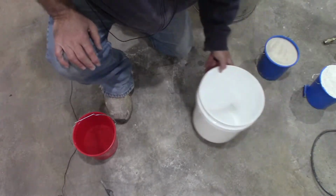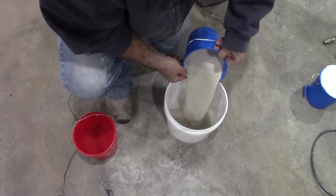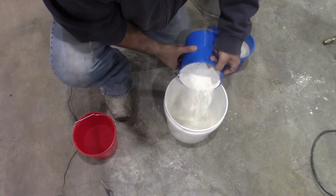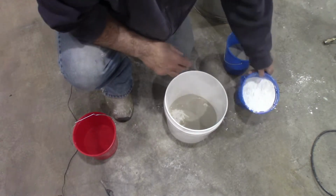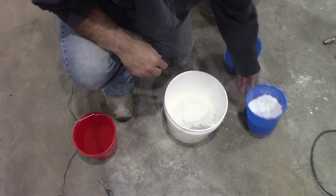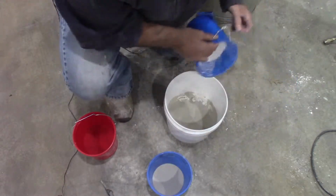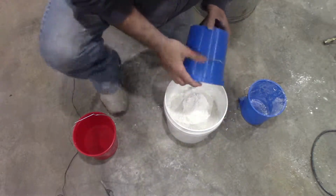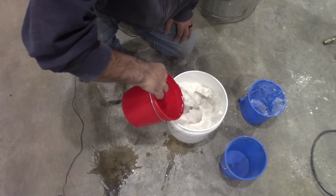Those of you who are longtime viewers of the channel have seen me do this. I'll link to the episode back, I believe, in March, where I originally made the big can. What I'm doing is really not any different except for the tuyere ports, which are still being cooked, so they're not really ready for prime time yet, but I'm planning on essentially building the thing up layer by layer like I usually do, except that the tuyere ports will somehow be incorporated into one of the refractory pours. So let's go ahead and make up our refractory.